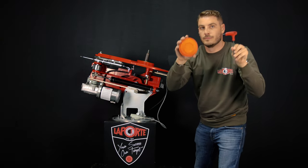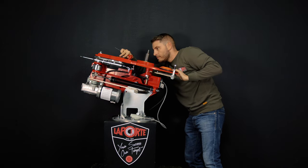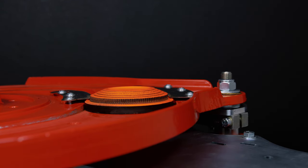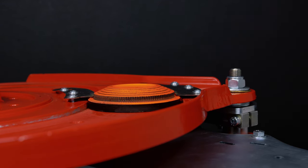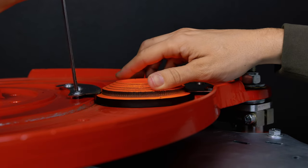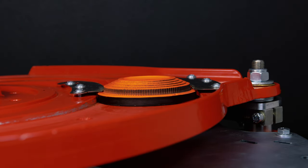Take your Allen key and 2 targets. You can check the spacing by moving your clay laterally — there should be a gap of a few millimeters. Be careful, there is a high and a low point on all brands of clays on the market. For a perfect adjustment, calibrate the knives by rotating the clay.